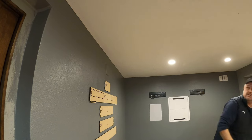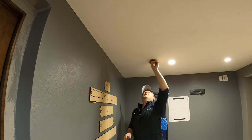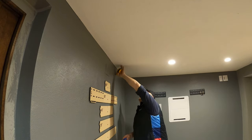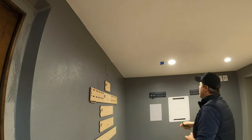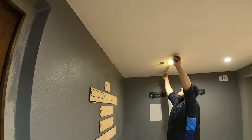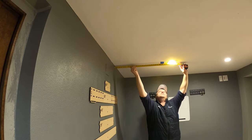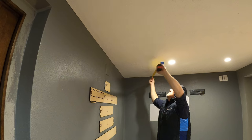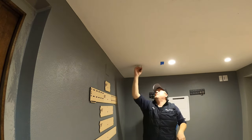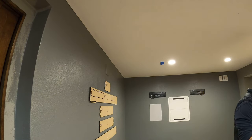On any job, make sure you check where your studs and joists are. We've got one right there, and it looks like we're clear right about here with some blocking. We're going to mark this stud and come off the common wall to find our center. Our speakers are 30 and a half inches, and from the center of the wall to the edge of the speaker it's 28 and a half inches. So we'll come over and make a mark at 14 and a quarter, double-check at 30 and a half — now we have almost an exact spot to cut.